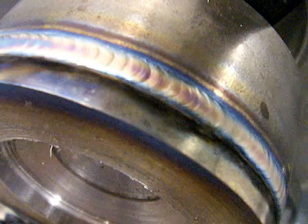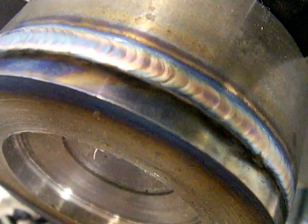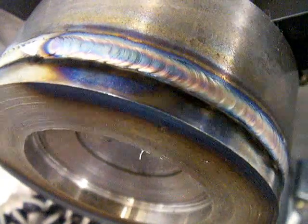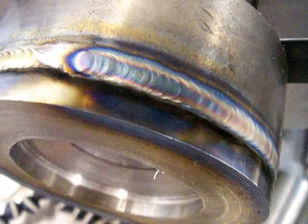Take notes — for example, for three-inch diameter it took a setting of about 2.2 or something like that. This particular part was about three inches in diameter, and using this method got it dead-nuts just about right. It was pushing just a little bit to keep up, but if you're in production, it's about where you'd want it. If you change to a smaller part, things might be a little different, but this eighth-inch increment method will get you in the ballpark — a lot closer than just guesswork.